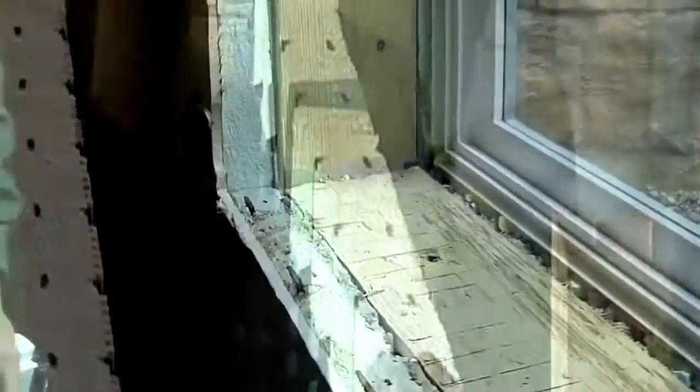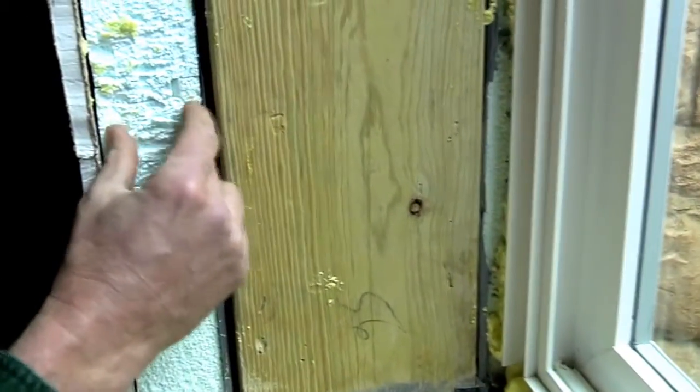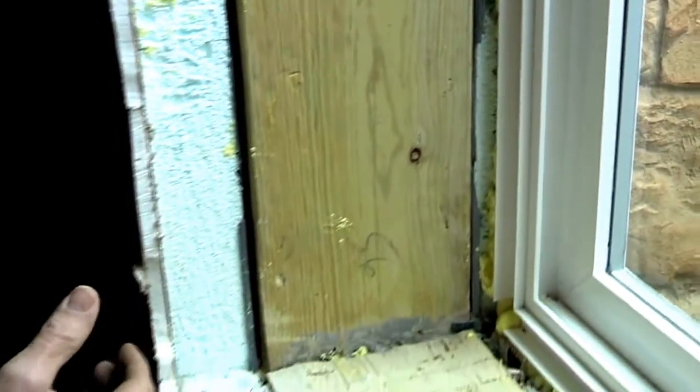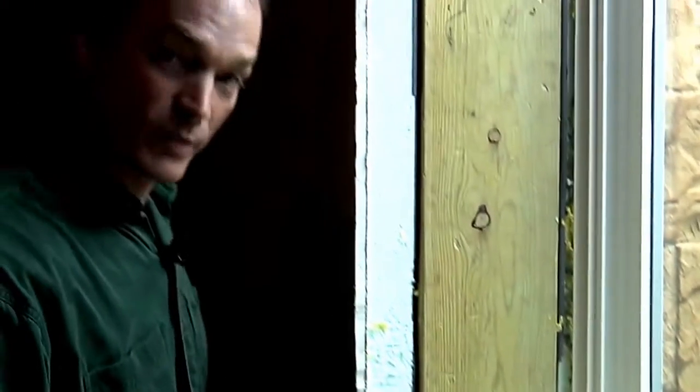We're stopping the cold on the outside and you can actually see here — here's the panel, the inside insulation and the outside. What we do is we waterproof the outside with a peel and stick membrane, so no water transfers through here — it's actually waterproof, not just damp proof.